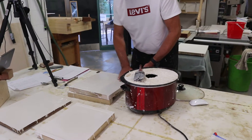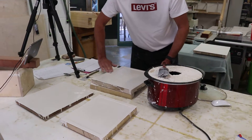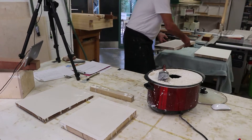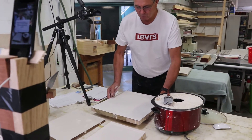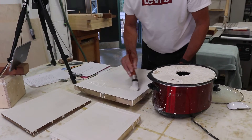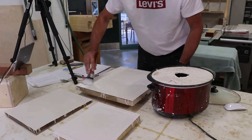Try to remember: if the board is shiny, you stop and wait. If the board is grey, it's good to go on. And if the board is bone white, it's gone beyond — you've missed the window. So you're looking at the colours and the shine on your board.